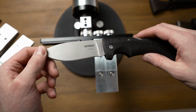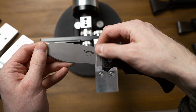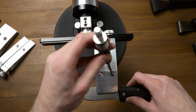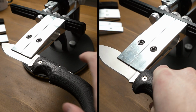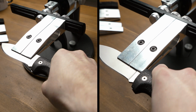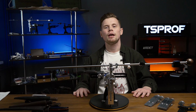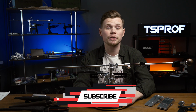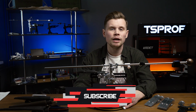However, you can clamp a Scandi blade by a flat surface next to the handle with one clamp right here and take the second point with another one. As a rule, every knife has a flat surface closer to the handle in most cases. Basically, for this kind of knife, it's better to use spring clamps, which we are going to talk about in our next video. Let's now take a knife with a narrow spine.